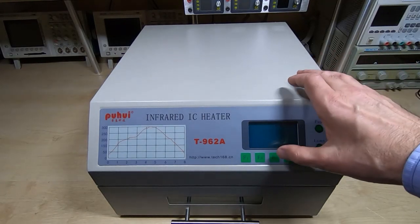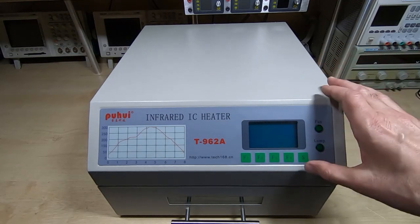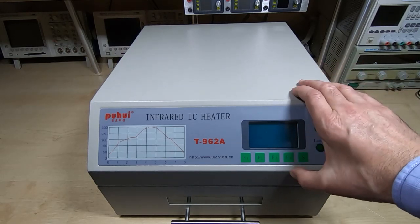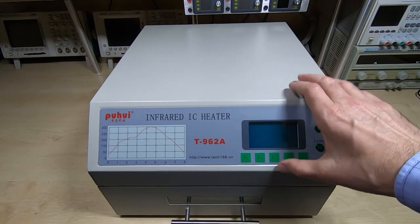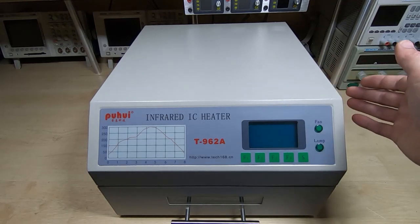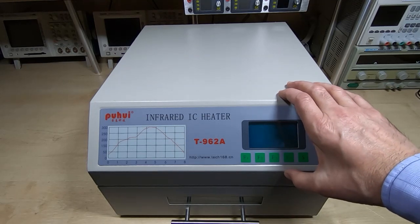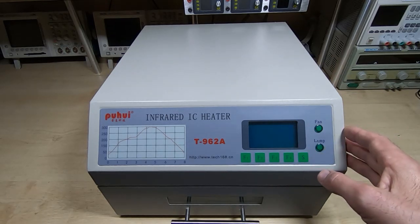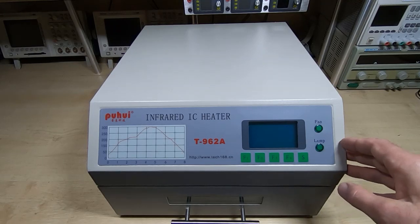Okay, so other things that have come up in conversation: I mentioned the flicker standard, and it doesn't really apply to me because I'm not selling these, but what I was really getting at is that the manufacturers of these, if they're trying to meet CE marking requirements, would have to take that into account, which would restrict what you can do with the firmware. You can get around it by changing the way that the heaters are controlled, the way they're switched.